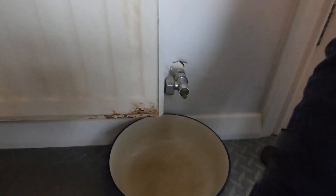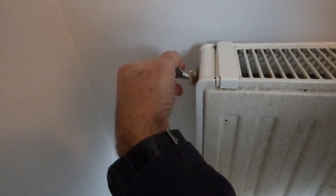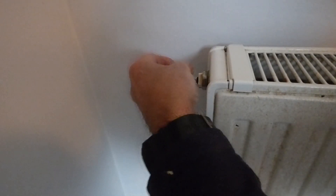Next we open the air screw valve on the top of the radiator. There's a little bit coming out but not as much as when I open it fully. There's the air bleed key on the centre — just open it up and that will let the air in and let it run out. As you can see there's still a lot of water coming out of the air screw. Now if it doesn't stop, it means one of your valves supposed to isolate the radiator isn't working, and unfortunately you'll have to turn the central heating off and drain it at least below the level of this radiator.